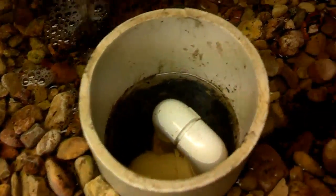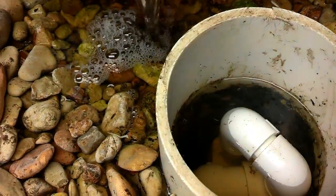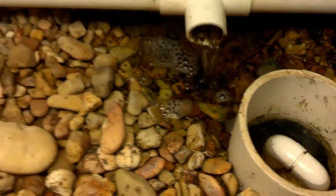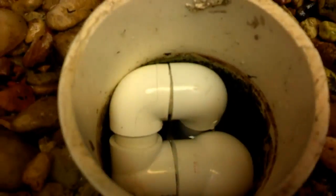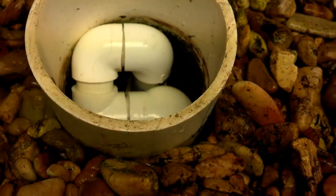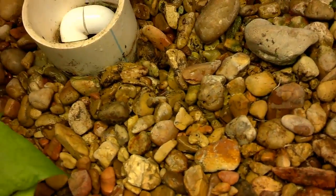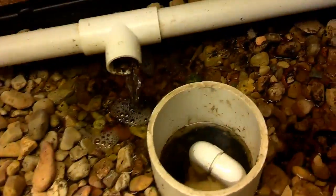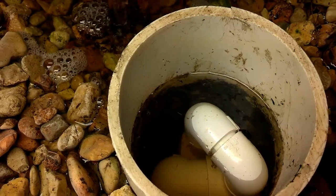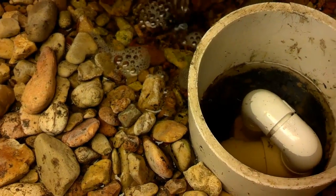I don't know if it's going to work if I raise it straight up — I'm about to find that out. I was canting it at about a 45, and that's just the larger pipe, 1¼ to ¾. It does seem like it increased — it still works and seems to make the siphon fire more quickly. This one appears to be overflowing now, so let's see if it's going to work.